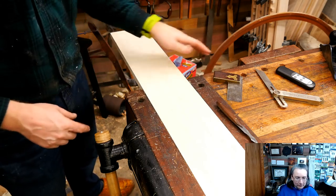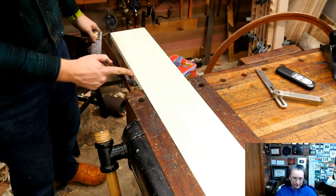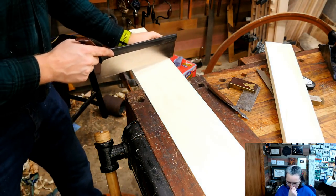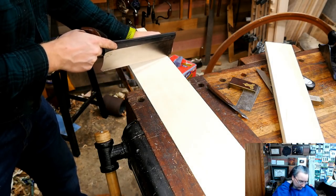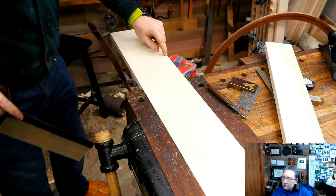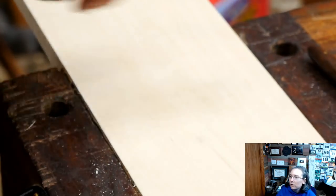So we have our line across here and I'm going to draw down the face — I'm going to put my knife right into that mark and draw down the face. We've got our edge there. Now what I'm going to do is the exact same thing I would normally do. Rather than cutting across the board this way, I'm going to turn myself to be over here. I'm going to pinch the board here and let my saw ride against my thumbnail — start the nick, lift the saw up, then slowly follow that line across the board. I've cut about three quarters of an inch into the board right now, just watching that leading edge of the saw as it slowly makes its way all the way across.